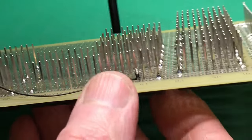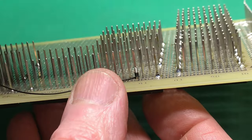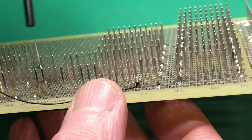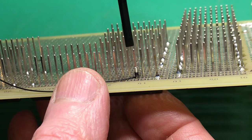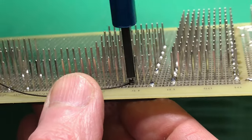Removal is just as easy if you need to change anything. Though, when you're actually building boards, you can stack two joints onto each pin if needed, or even three if you're careful. So it's best to stick to two. For any changes, use the other end of the hand tool, just spin it back a couple of times.